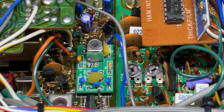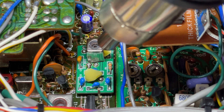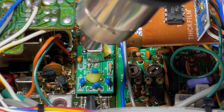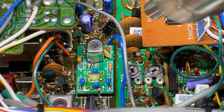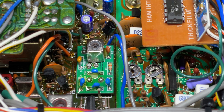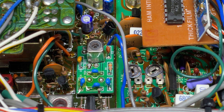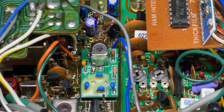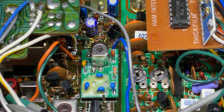We're going to add a little bit of beeswax onto the capacitors, just as good practice in case they get microphonic. We're using a hot air gun to gently melt the beeswax. It's cooled off now — very happy, looks very good.